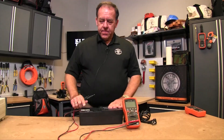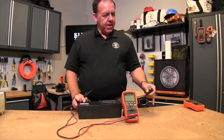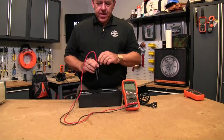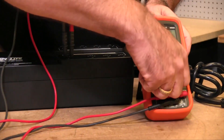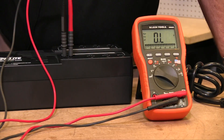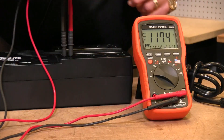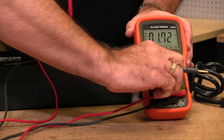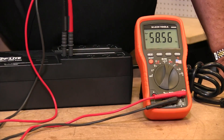Let's turn this on. As you can see, it's not plugged into anything. But if I measure what's coming out of this jack — let's measure voltage first — I have 119 volts coming out of this battery backup. Let's remove this lead when I switch over to the frequency position. Stick it in. And I'm measuring 60 Hertz.